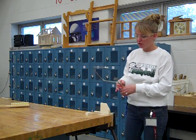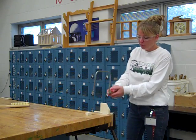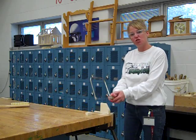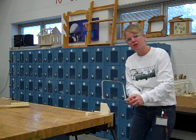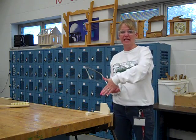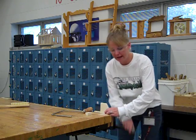The last thing I want to talk about is when you are cutting, make sure that you're keeping your blade straight. Sometimes people tend to hold it at an angle, so when they cut they're actually cutting their material at an angle instead of it being a nice, smooth, straight edge like I have right here.